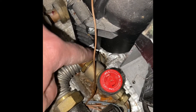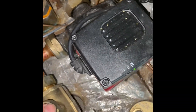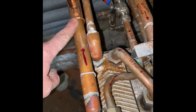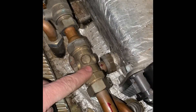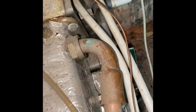Now looking at this on a real boiler — this pipe comes out of your primary heat exchanger. There's your central heating pump, which pumps it along to your diverter valve where it has a choice to go down to your hot water buffer tank or carry on through your radiators. Following the arrows, the flow goes off to some radiators up in the roof. Here's your return pipe going off to a filling link, coming back in through this tee piece, then up into your secondary heat exchanger. This drags your flue gases down and helps the boiler condense, then it pops back out and goes back down to your primary heat exchanger to be reheated.